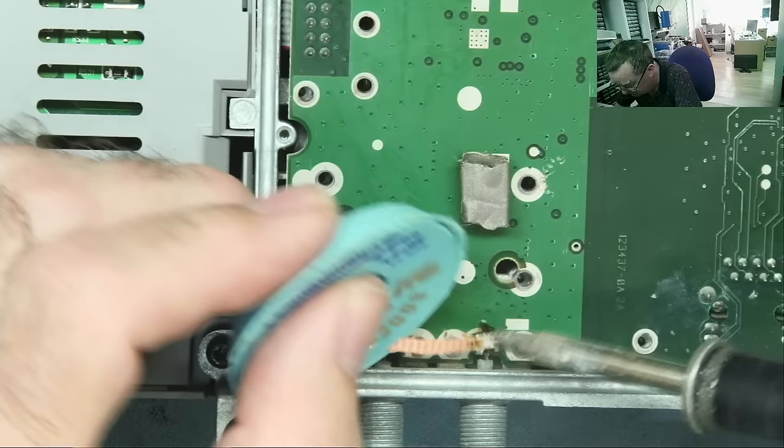So if we measure here, that is probably the capacitor. Yeah, let's have a look. It looks that way. I can say this is a bridge rectifier. And there's about 16 volts in it. This is the negative end. This is the positive end. So yeah, about 16 volts slowly discharging. Because the power supply is running, you'd pretty much expect that to happen, to be quite honest. So it's not dangerous.